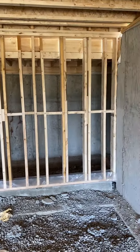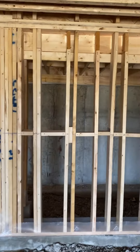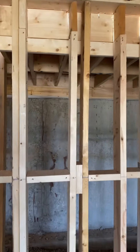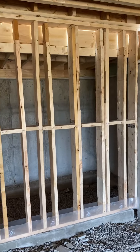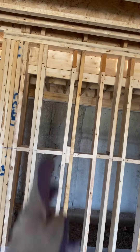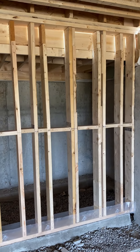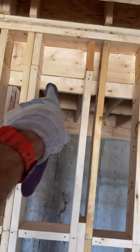This wall here is the bearing wall, two by six. Looking back, since the sunken floor is two by eight, twelve inch on center — I probably should have just made this wall twelve inch on center, although it does call for sixteen on center. That way I just do a stud and a jack type thing for each. This kind of looks a little nicer, but either way I'll have to knock out this two by four ledger.